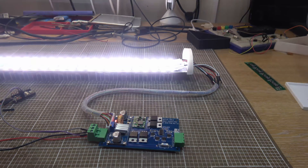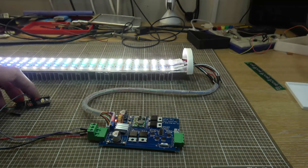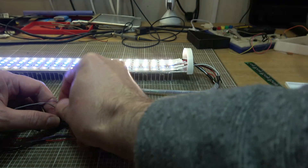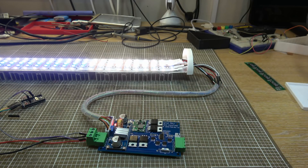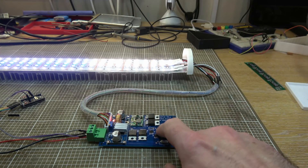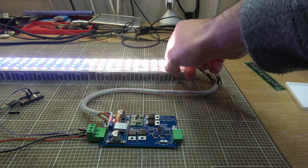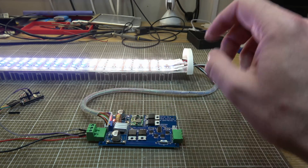Back to debugging this flickering light problem. Things have improved because I actually did a little bit of debugging off-camera, so I'm just going to unplug the signal going in here to stop epileptic seizures and things like that. There were a couple of problems I've already corrected - there was a pin lifted on one leg on this chip where it hadn't soldered properly, which is why that strip was locked on solid the whole time.